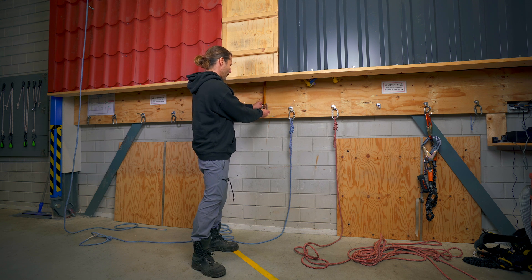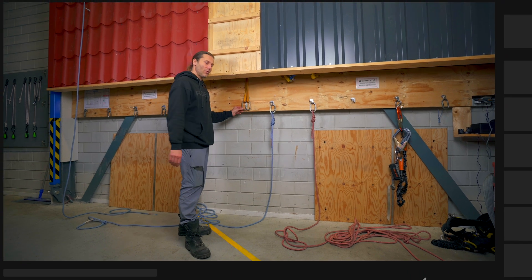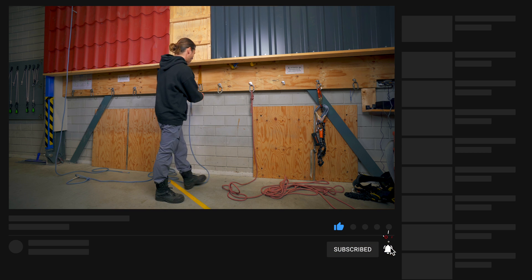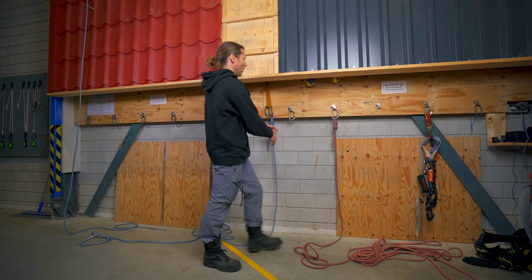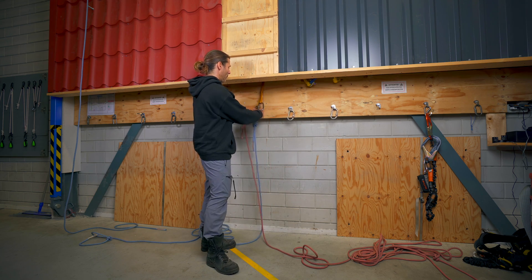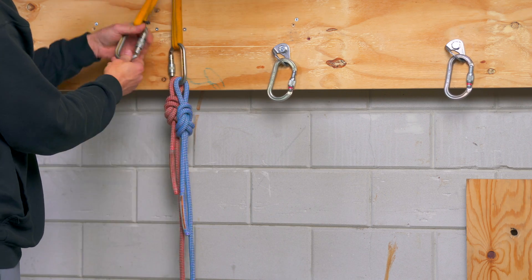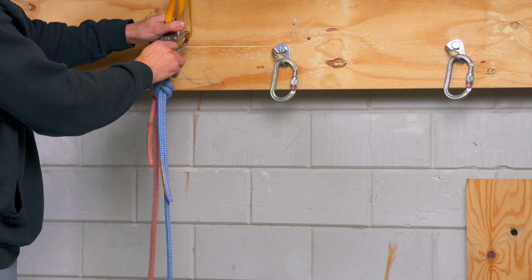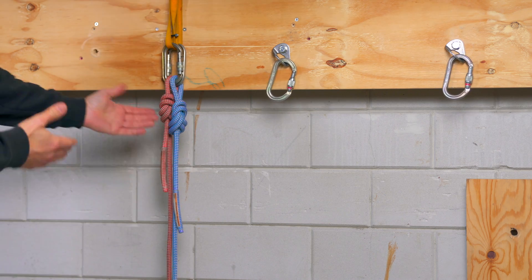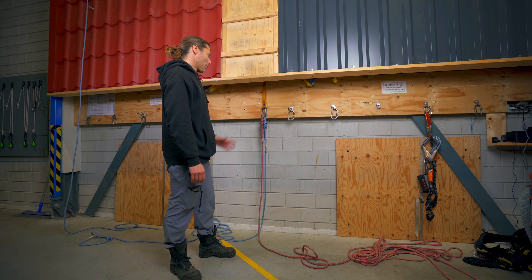Another example of basic rigging — the kind we use often — is if the anchor points are really close to each other or on top of each other. Best practice, and what a lot of people in the Netherlands like to see — I can't speak for the whole world, but where I work — is to put both of the bights in one carabiner, and the other carabiner through both of the bights as well. Basic rigging. The load is shared, and should something happen to one sling, there will not be a shock load in the other sling.